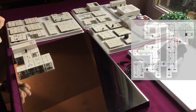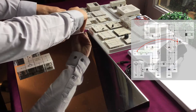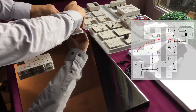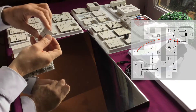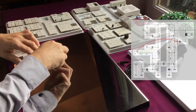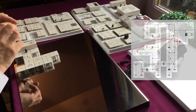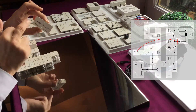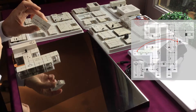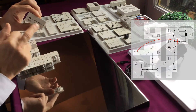This needs a feedback resistor, so we use a corner block here. We add two resistors here to make feedback later on — we use a 10K and a 5.6K resistor. These can be mounted this way or the other way; it's the same.